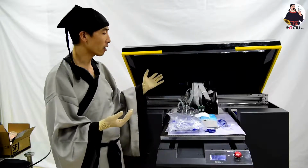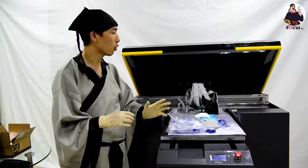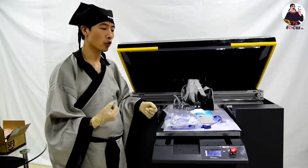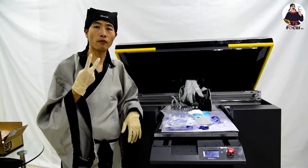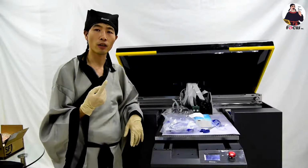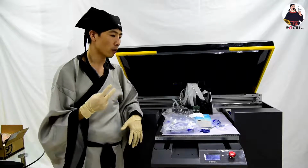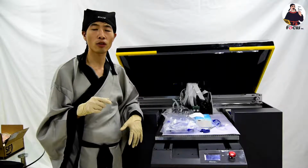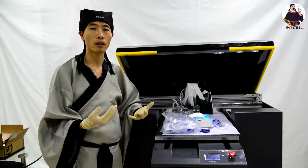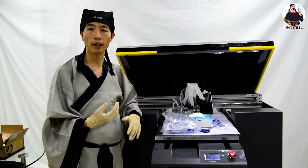Or, if the ink tank doesn't have enough ink and you don't refill it, the ink tube fills with air, so you need to load again. So there are just two reasons you need to load by hand. First, the first time you put ink into your new machine. Second, you forget to keep loading ink into the ink tank, so the ink tank is empty and makes air in the tube and the damper, so you need to load again.